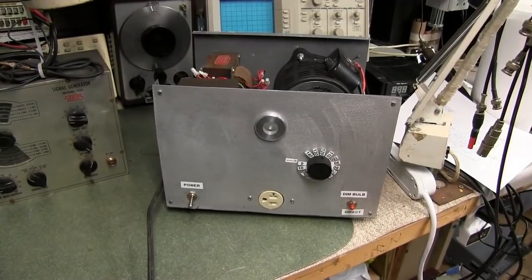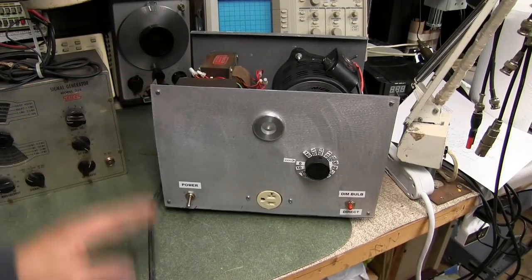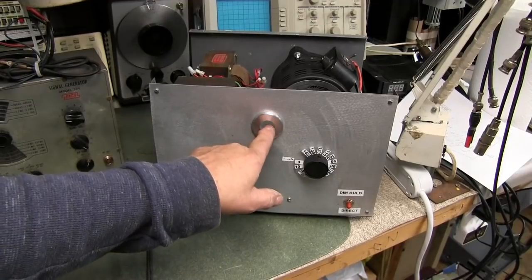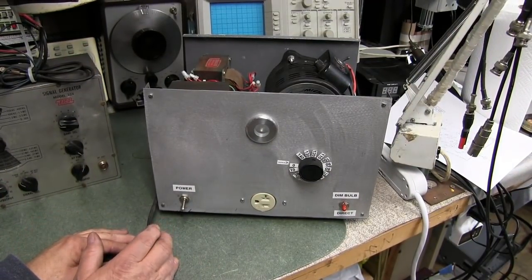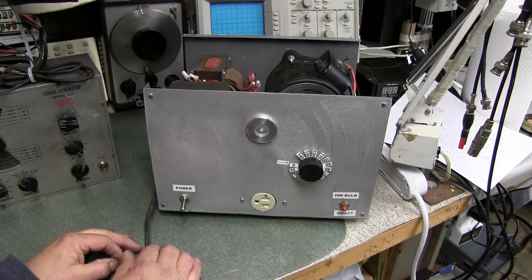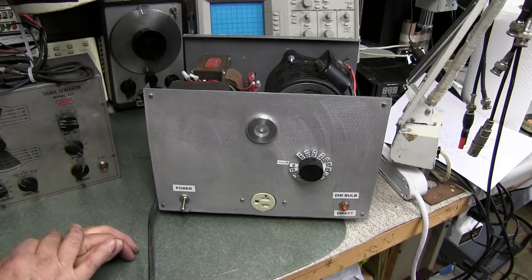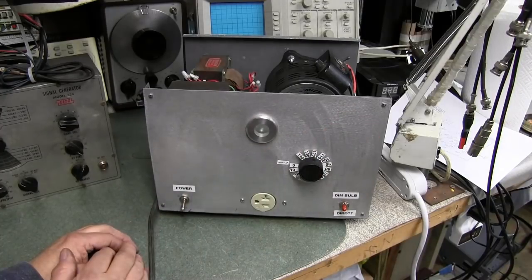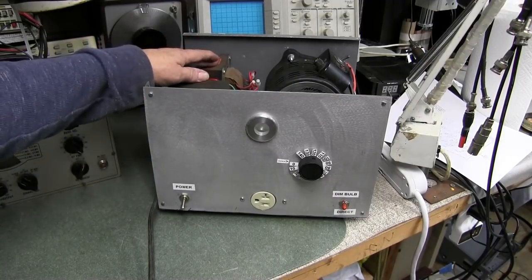I'm in the process of finishing up my new isolated current limiting variac AC supply. I'm just about finished with that. As you can see, the light bulb is inside. There's a little aluminum ring here, and that's the light bulb on the other side. Now I want to find a panel meter to go in here, and I was looking at using old analog meters, but I've been looking on eBay at some of those cheap Chinese meters that show voltage, amperage, wattage, power factor, energy, different things. So I haven't made my mind up yet on how I'm going to go with this. I think two old school meters on here for volts and amps would look nice, because it's kind of old school built, uses two transformers as isolation.